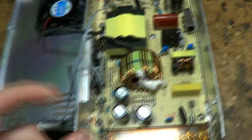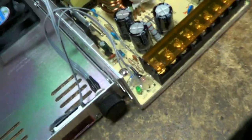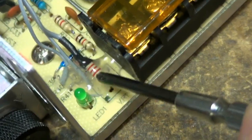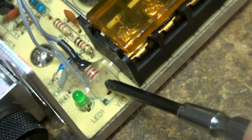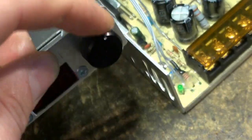I traced out the entire circuit — a schematic is available on the website below. Basically I removed the original voltage feedback resistor divider. There was a little trim pot that let you trim the voltage plus or minus 10%. I removed that and added some new divider components plus an external 10k variable resistor.